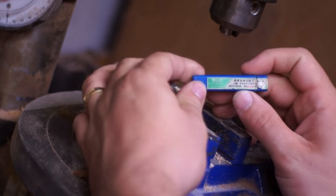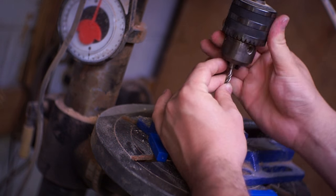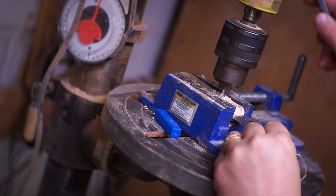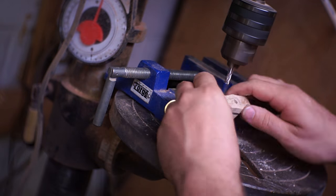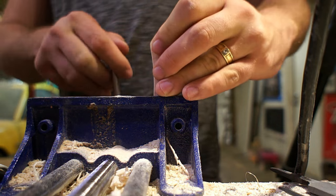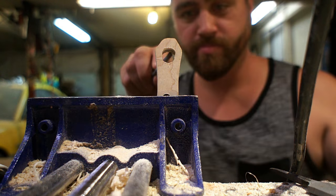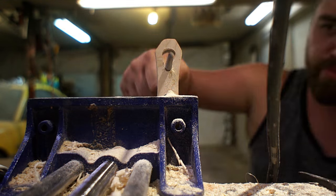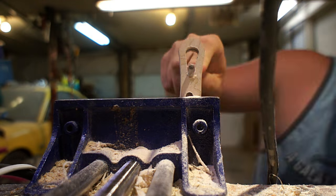So this is an end mill and I had kind of been wanting to try it out on my drill press and see how well it worked — another impulse buy off eBay. I wanted to test it out, and since I couldn't use pins through these holes since they're obviously too big, I decided I would hollow out that whole recess and fill it with some epoxy. I had figured since these were used on metal that it wouldn't have much of a problem with wood and would cut through it really quickly. It didn't end up cutting through as quickly as I thought, and I didn't have as much control making it parallel with the sides. So I got the major holes drilled out with that just to start, then came back in with some files where I felt I had more control over the process and could shape it more easily.